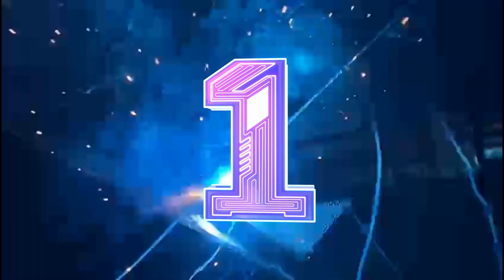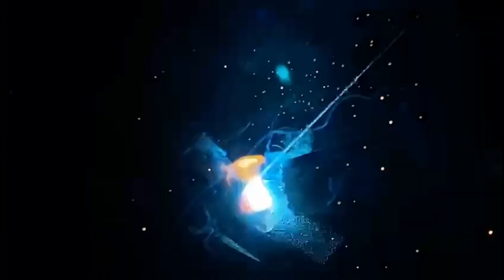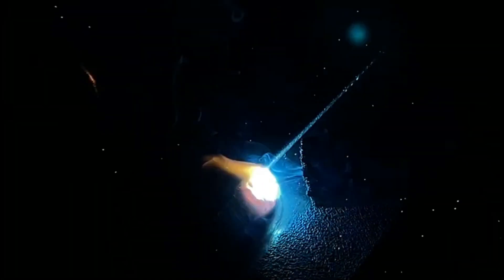On today's video we're going to show you a little trick with MIG welding, and it's going to involve a series of U shapes. So if you imagine in your mind the letter U and then crossing over — as you can see from this puddle now — that's essentially what we're putting onto this lap joint.